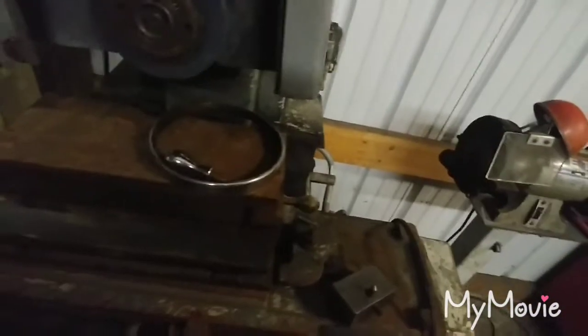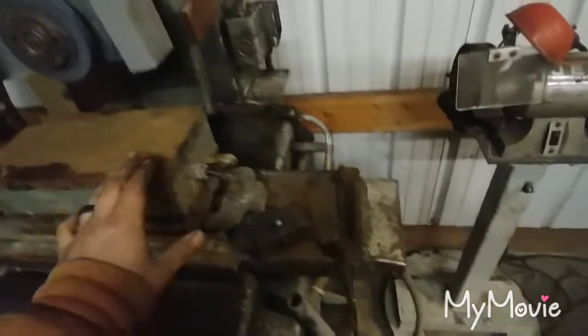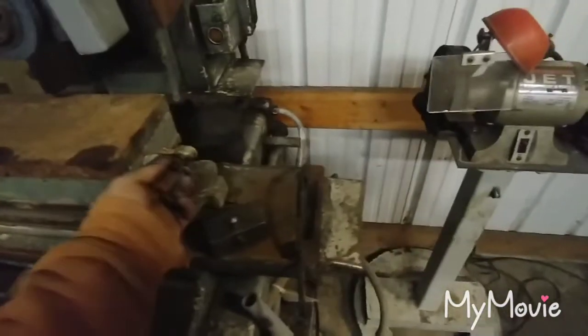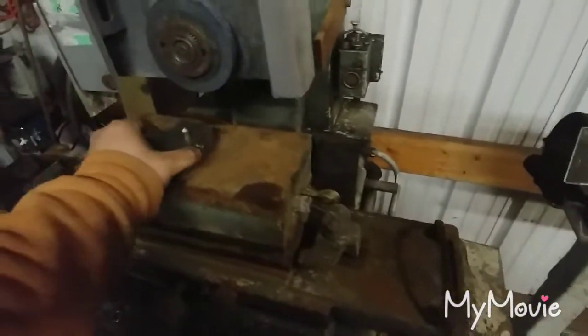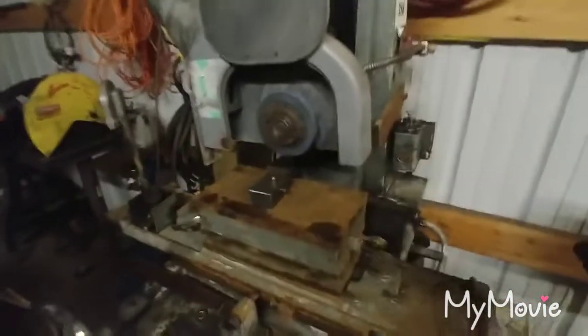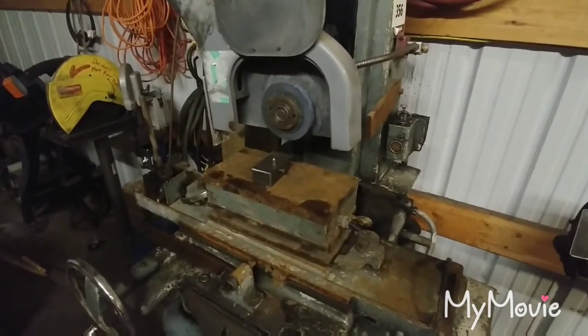The handle on this is broken — well, this is for the magnet. All this goes to here. I'm not gonna use this diamond yet — I gotta get all this cleaned up, all the rust off of it, bolt this table down, get the magnet working. Once the magnet's working I'm gonna grind this all so it's parallel with the machine. All this'll do is sit right there, magnet down, then you bring the wheel down, touch off, and adjust the wheel. There we go — there's the little diamond holder. It's all right, and you can see it.